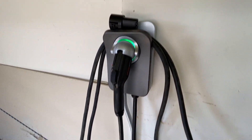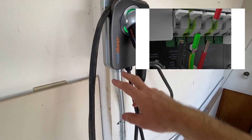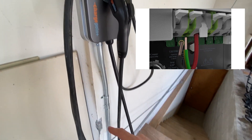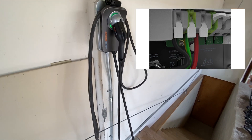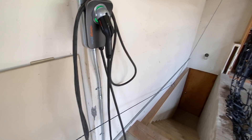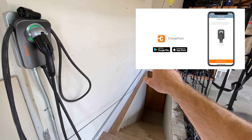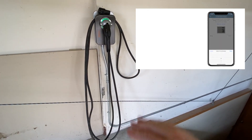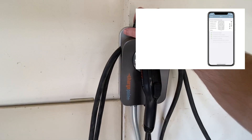ChargePoint makes it super easy to install. There's a bolt up top and a bolt in the center behind the panel. You just disconnect the plug, pull the easy pop tabs, pull the wires out, run your conduit into the unit, and do the hardwiring with 6/3 wire through the conduit. Put the template on the wall, drill your holes, pop the unit up, run your conduit, get your dimensions for the bends, install your upgraded circuit breaker, run the wire, turn it on, and the app takes you through everything.